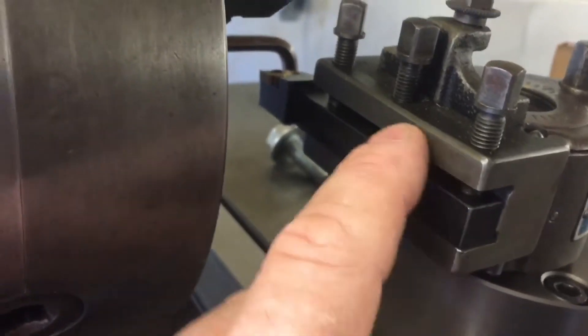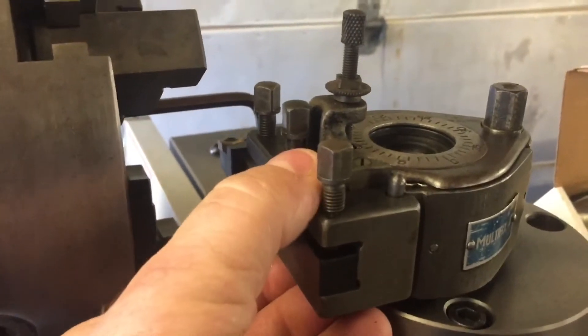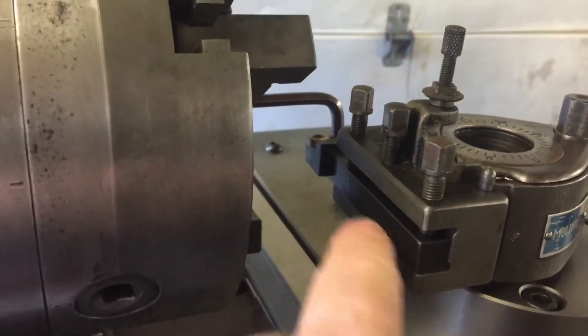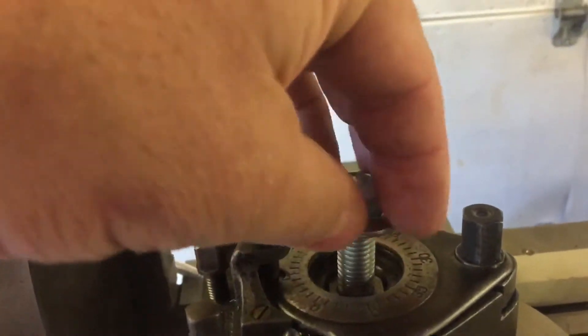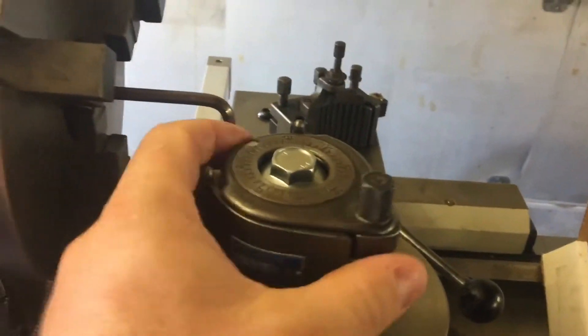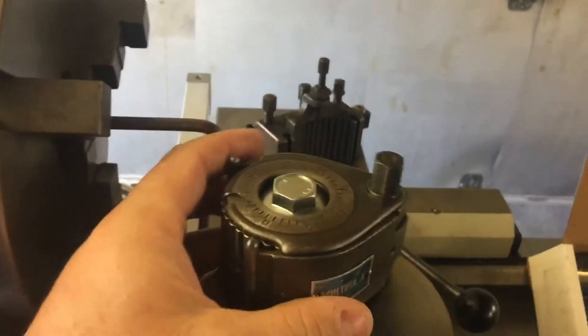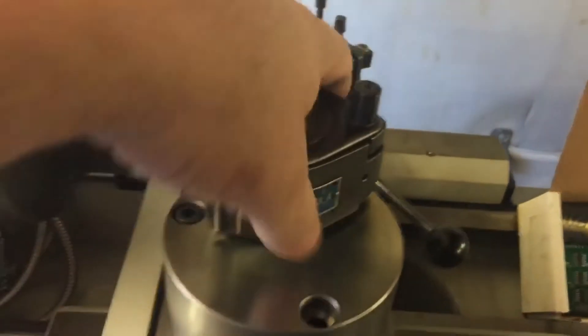I think this is 12mm tooling, so if I go to 19mm tooling the tool height will rise up relative to that and will end up back at the natural height. I can put a block underneath these when I clamp them — just grind some blocks up on the grinder. The idea here is using Multifix so I can block it that way, turn the post around for boring, or for whatever reason I need to go further out or in. I have the option to position this post pretty much anywhere that suits just by unbolting and re-bolting the clamps at the bottom.